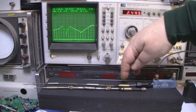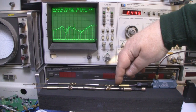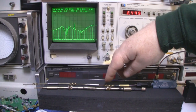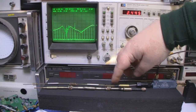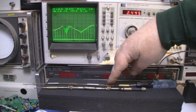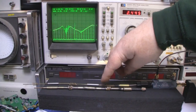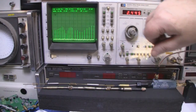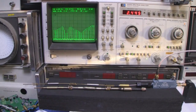And with this antenna it doesn't work very well, and here you can see we've got this section here which is at 10 millimeters, and we've got this section here and that's 15 millimeters, and we've got this extra long loading coil here, longer than the other loading coils. And I did think that this was because this wavelength here is too short, and so is this wavelength, and it was kind of balancing it out. But you can see here on the spectrum analyzer that the main frequency response for this is way too low.